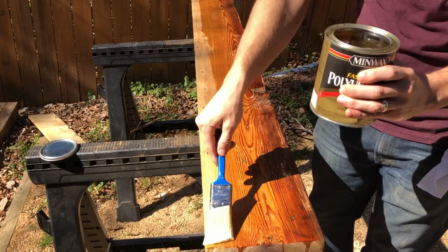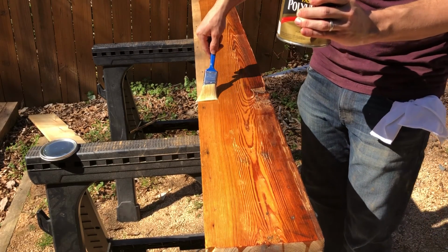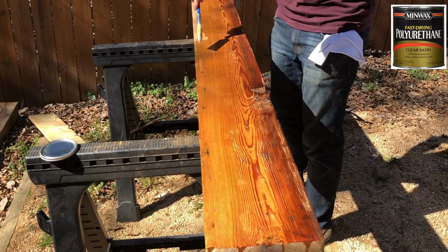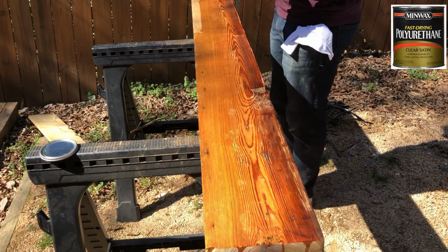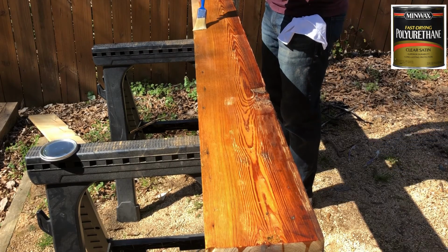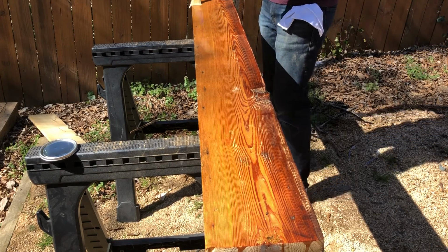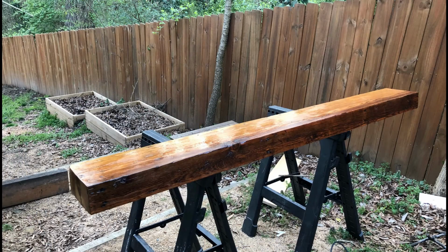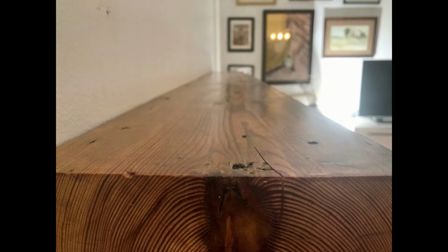We decided not to add a stain because we preferred a more natural look with the wood, but we did add polyurethane for durability. When applying polyurethane, don't think of it like applying paint. Instead of going back and forth, use long, fast brush strokes in the same direction. We ended up adding 3 coats. We used a quick drying formula and waited around 1 hour in between coats.